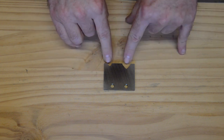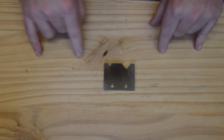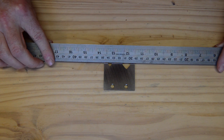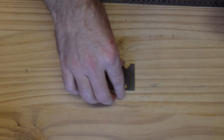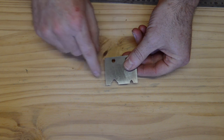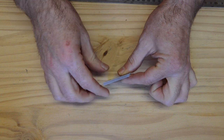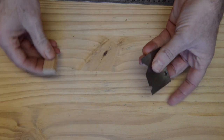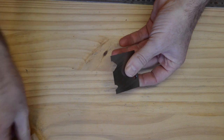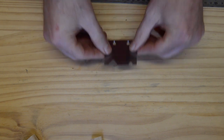You can see there are two different sections to the knife. That helps you get the full width or thickness range of the dominoes, and you can see that the largest one goes right up to the 14 millimeter domino used in the Domino XL. Just a quick reminder that the profile you see on the ground knife isn't actually the exact profile that will be milled in the stock, because the knife is held on an angle — often called the hook angle — which distorts the geometry a little bit. But if you artificially hold the knife at the hook angle, you can see that the profile is milled very accurately.